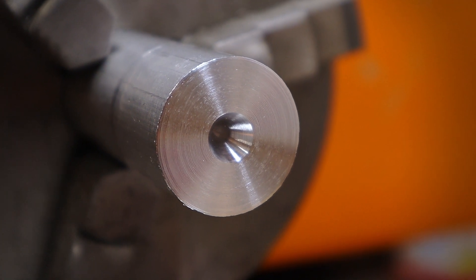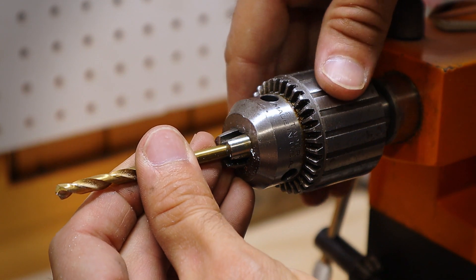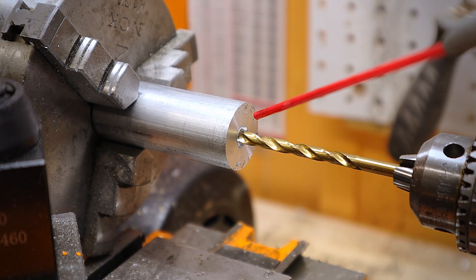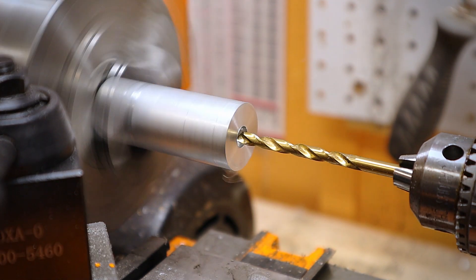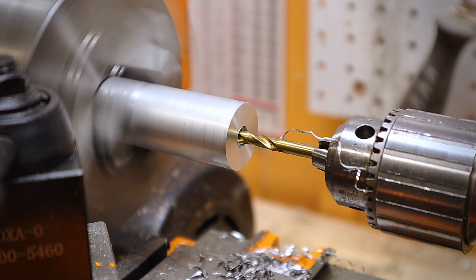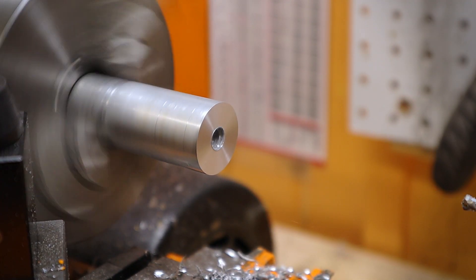That's some delicious pilot hole. After the pilot hole is drilled, I then grab a 13/64th drill bit. This is the first of two holes we'll be drilling for this project. When drilling a hole, I was taught to always use cutting lubricant — in this case, good old WD-40. For this piece, we'll be drilling all the way through so we can tap the hole later. Just remember, drilling a hole isn't a super fast process, so the same rule applies here: use slow and steady pressure.